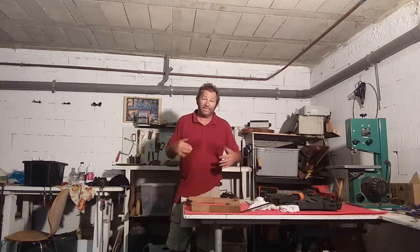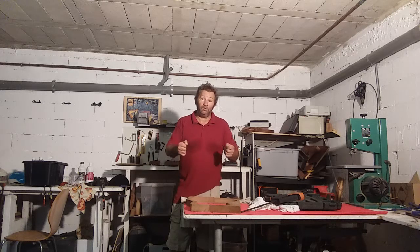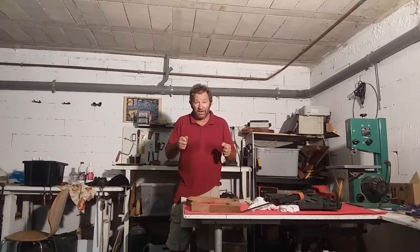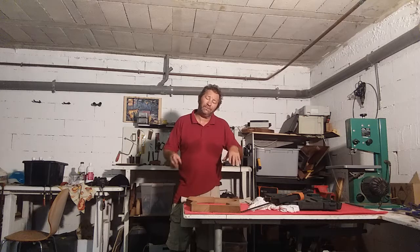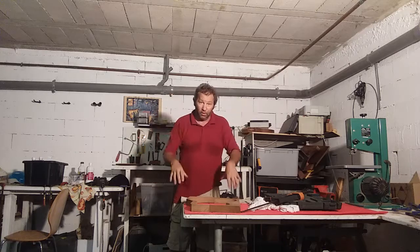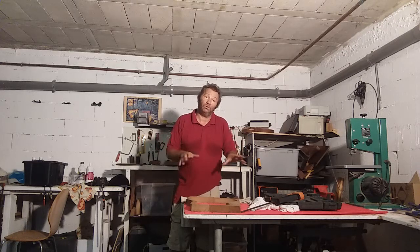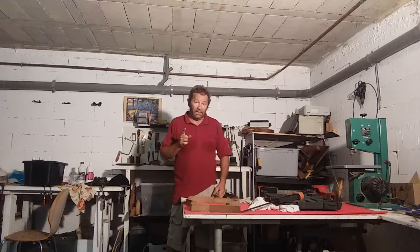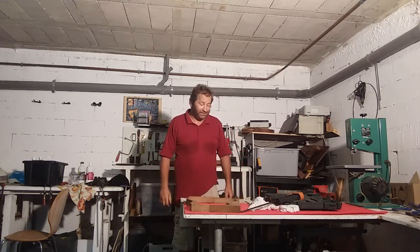If you're doing a run of the same guitars, you can figure something out. If you're doing your routing from the top with a handheld router, not a pin router, you can create some sort of locating pin on the template, so you don't have to draw centre lines. It should just drill a couple of holes on the first pattern, and the next patterns all locate in those holes, and it should be all central. So I thought I'd give it a go trying to make a template like that for my TPC 15 guitars.